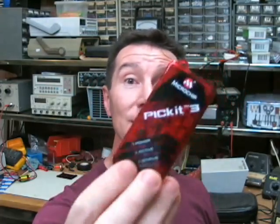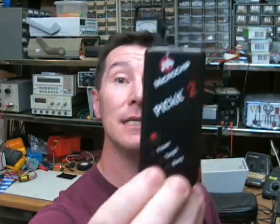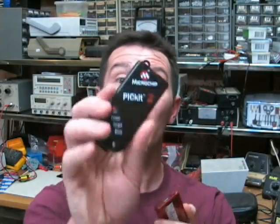The reason this new one is more expensive than the old one by $10 is because they use a new 24F series 16-bit PIC in here — it's a much bigger and more powerful PIC controller — as opposed to the old one which had an 18F series PIC in it. They're both a standard USB interface, but the new one's gruntier and more powerful. But it only works at 3.3 volts, not 5 like the old one did, so they have to have some extra voltage regulator in there. And they've actually put in some poly switches for protection, which is a fairly good addition.